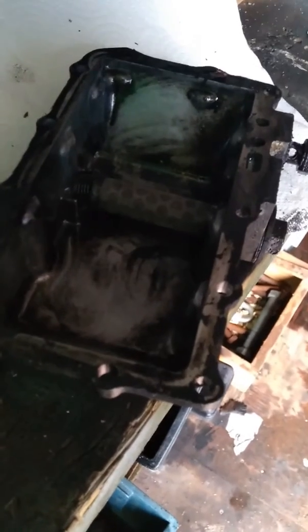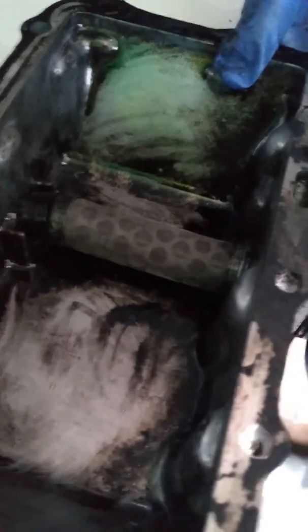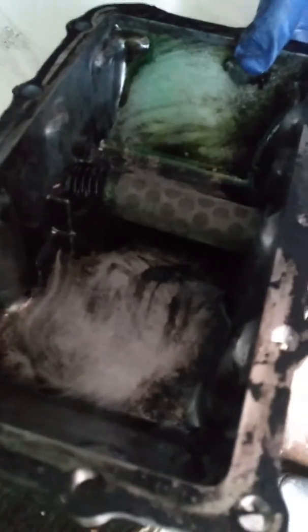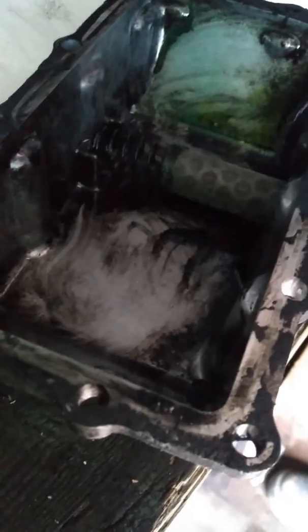We discussed in one of the previous videos about this spring inside the oil drain plug. There's a tube. It's a strainer. That's a strainer tube. And the spring goes inside it. So when you unscrew it, if you take the plug right off, make sure you've got the spring with it, which you probably should be okay with. So there you go. Plug off, and then this is it. The oil goes in through the gauze, out this end into the oil gallery.